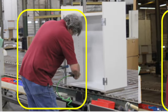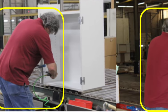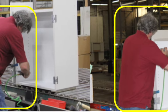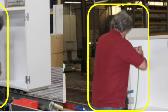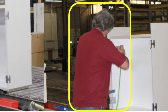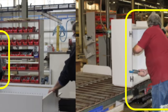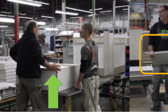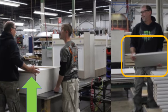Awkward postures and forceful exertions are observed during the door hanger task. Forward bending of the neck and torso, neck twisting, and outward rotation of the forearm are seen in order to secure the lower hinges with the screwdriver. Also, elevated arms are required to secure upper hinges using the screwdriver. Forceful exertions are required to drive screws to secure the cabinet components and to position the clamp as well. Mechanical contact stress is seen when the hand and palm are used as a hammer to position the cabinet pieces.